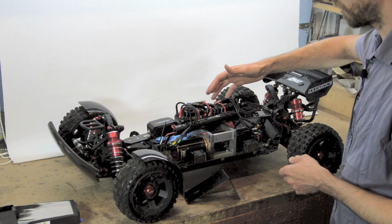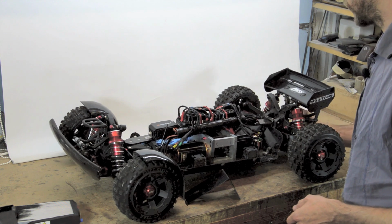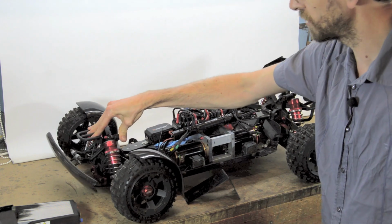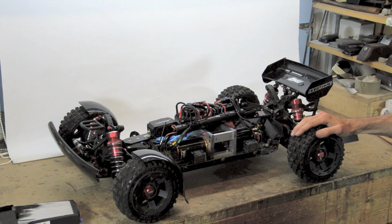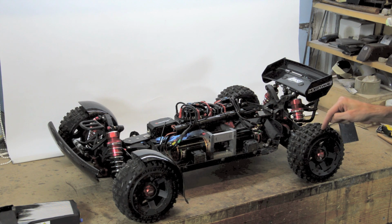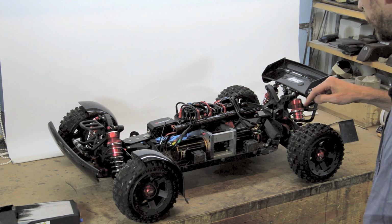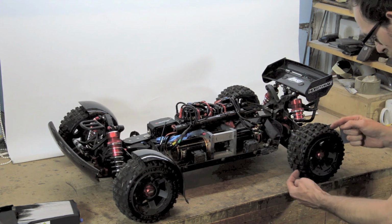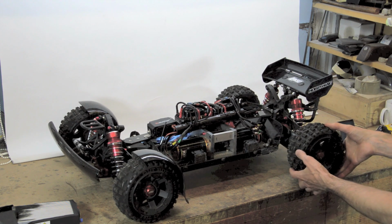So yes, you haven't got a differential, but to be honest, this thing doesn't really wheelie or anything like that. It just loses traction because it's got so much power, and it's so low because these are Baja back wheels, so they're lower than the standard DBXL. I've got these wired with trawling line, and I've done a few other videos on my channel if you want to check those out. It's got 120 pounds tensile strength just wrapped around, and you tie a knot in it in a few places and super glue it and tuck it in, and it's got tape underneath it.